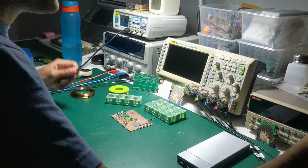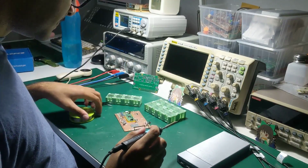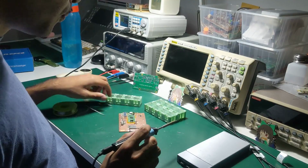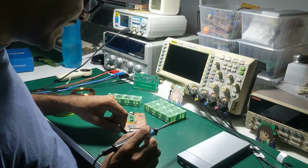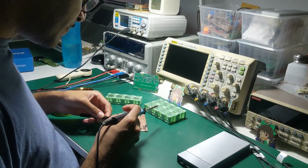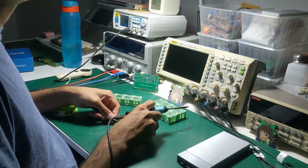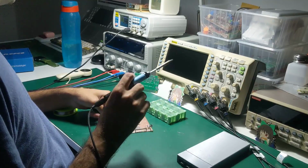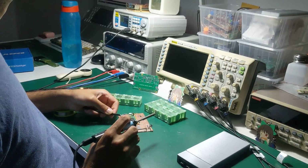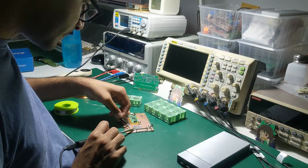He put a 1 microfarad capacitor across the base resistor. To be honest, I don't remember the number. It was a 104 ceramic capacitor. That's 100 nanofarads. Fine, put that microfarad. It's an order of magnitude wrong. 3 orders of magnitude wrong. I'm drunk, wait. 100 nanofarad and 1 nanofarad. I mean 1 microfarad. That's like 1 order of magnitude. Oh, okay, I thought it's 10 microfarad. No, that would still be 2 orders of magnitude. No, micro to nano, that's big.